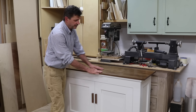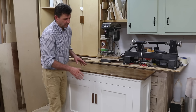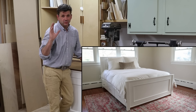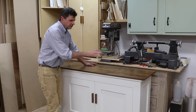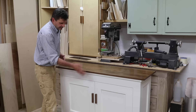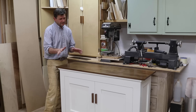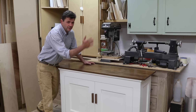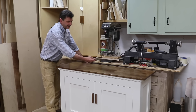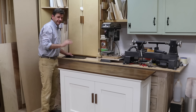In this video I'm going to be building a TV lift cabinet. I'll be using the Whisper Lift 2 made by Touchstone Home Products — it's a really quiet, strong lift and it's really easy to install. When you buy the lift it will come with SketchUp plans for this exact design. I designed it to match the storage bed I built a few months ago. Basically we're talking about a plywood box dressed up with some moldings. I use a piano hinge to attach the top — anything on top will fall off when the TV comes out. If you want it flat, the lift comes with a bracket so the top remains flat and anything on top should stay.